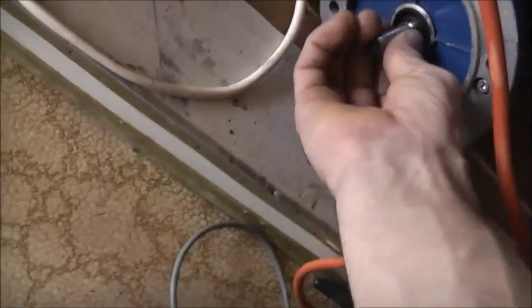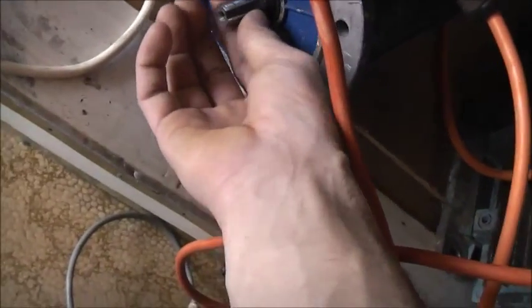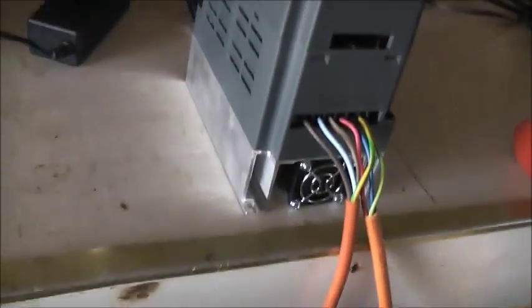I think the drive's not set up right — it's inducing too much heat in the rotor. Interesting — it does it with this motor though. I might try and program the parameters of that motor into this drive, see if that makes a difference. Next job — make a terminal cover for this thing. Thanks for watching.